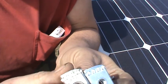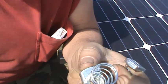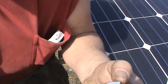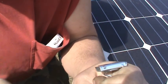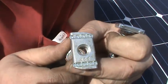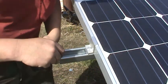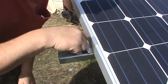I've got a buddy out there in Oklahoma, and I noticed that his were installed in the Unistrut in the wrong direction. When you take your bolt and you tighten it up, it's going to make that spring nut turn. And if you notice, it's kind of rounded off on each end. You don't want them upside down, because if you tighten it down, those are going to spin out and could pop out of there. If it's upside down like that, it slides back and forth real easy.